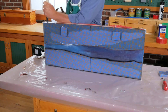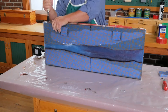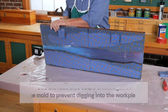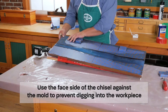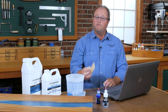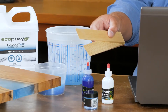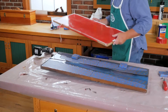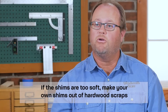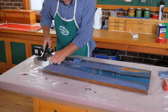The bottom part of the mold was the hardest to remove because there's so much surface area. We used a hammer and a chisel to break that bond, however we ended up with a few small gouges on the back side of the workpiece. Instead, consider using a few shims as wedges — you can drive the shims between the workpiece and the mold to help break that bond. If you don't have any shims on hand, just make your own from scrap wood.